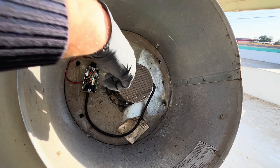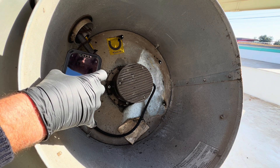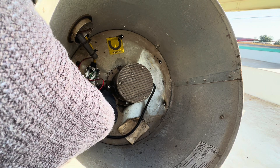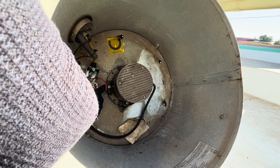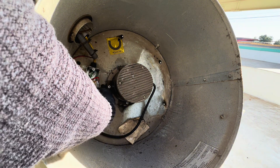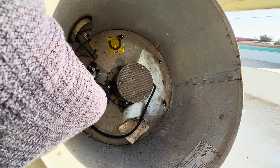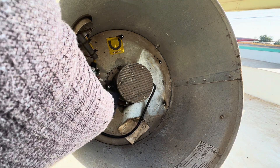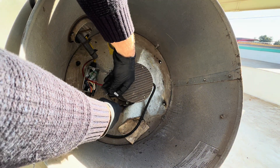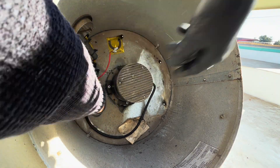That's all of them. Usually I do the electrical first — let's take a picture of this so we remember. The red one is our PWM signal, zero to 24 volts DC. This was putting out 19 volts, but when the motor was trying to run it would reduce to 11 volts — telling me the motor was trying to run but wasn't actually spinning. That's how you can confirm it. This comes from a control panel downstairs. It is DC so you have to mount it correctly. This is our neutral — it's 115 volts on this one.